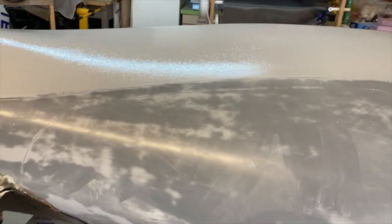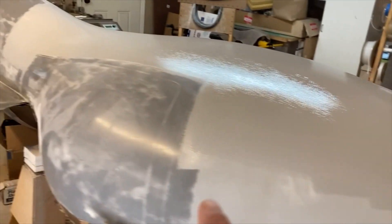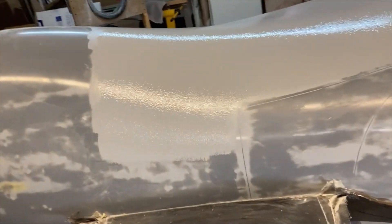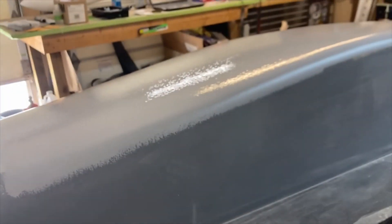I got the primer all applied. I roll my primer on rather than spraying it — at least for small stuff like this. One, I don't have to clean my spray gun; two, I don't have to mask anything; there's no overspray so the odor is much much less. With a roller you can actually get quite a bit on there in a shorter period of time than spraying. The downside is there's a little bit of texture to it, but this urethane primer sands so nicely I really don't mind that trade-off. I'm going to let this cure and hopefully tonight I can start wet sanding it, then from there it's just on to polishing.